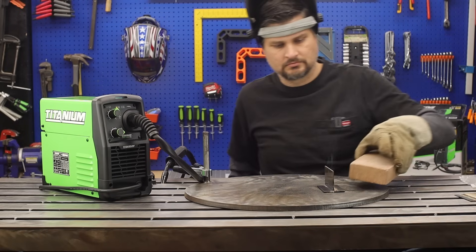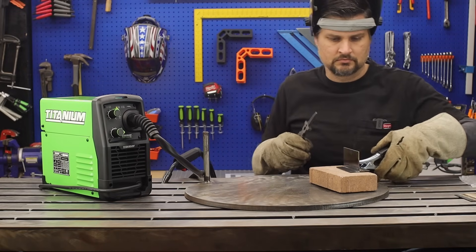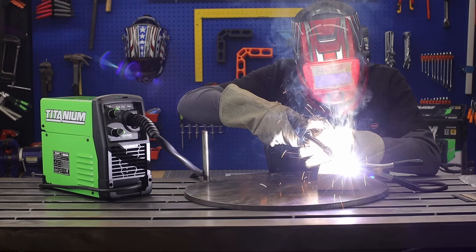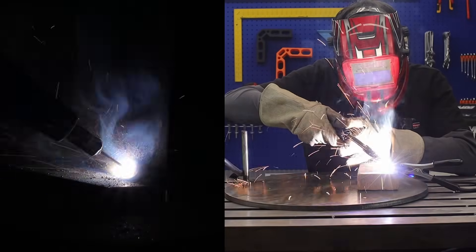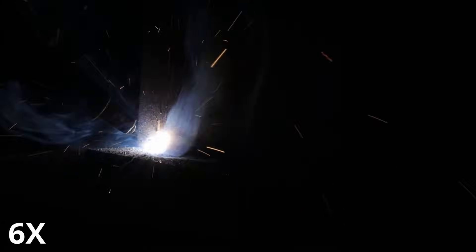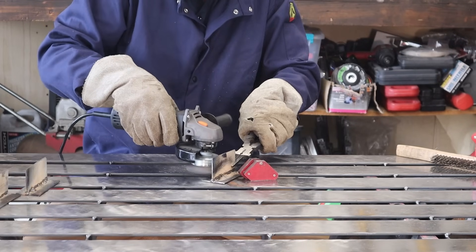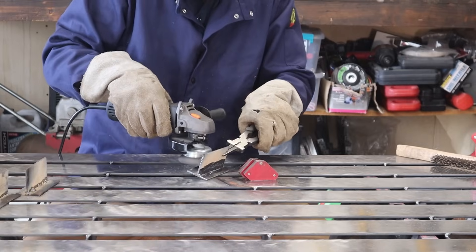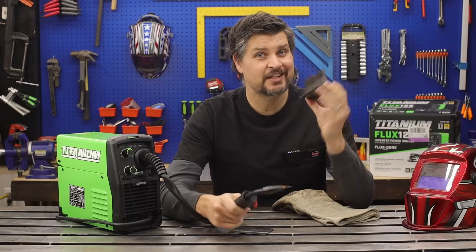For this last weld I'm pulling out the brick — just to show that you don't need a welding table or fixture table to get a good weld. For many years I was straight up on my garage floor, sometimes using bricks to hold pieces in place. Keep an eye on that stick-out and get out there and start practicing. When you're done, don't freak out with how dirty the welds look — that's from all the smoke, spatter, and dust you get with flux core. There's no way around it, but a lot of passes with a wire brush or a quick pass with a wire wheel will clean that right up. $200 bucks and you get these welds?